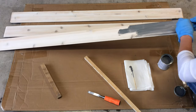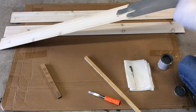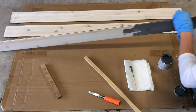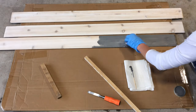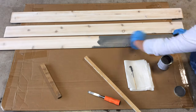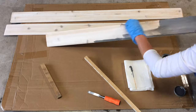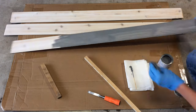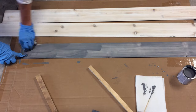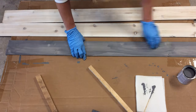I've found that different types of wood accept stain differently. For the backboards, all I had to do was put the stain on and pretty quickly wipe it off with paper towels. The smaller pieces that I put the lettering stencil on I had to leave the stain on a little bit longer. Make sure that you wear gloves while staining.